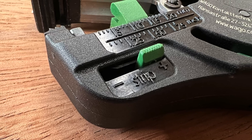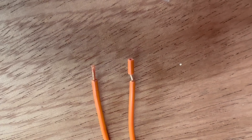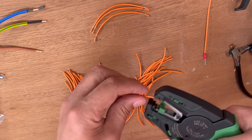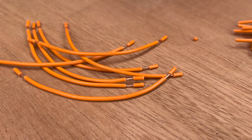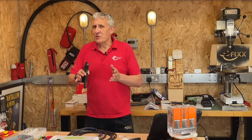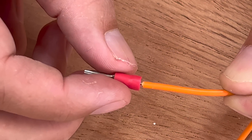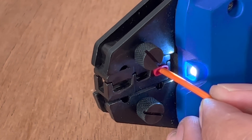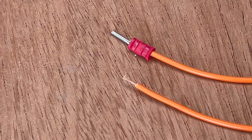Now let's talk about that mystery function. By using this lower slide, you can part-strip a conductor, leaving the insulation slug intact at the end of the conductor. This technique comes in handy when preparing a large number of conductors that need to be terminated or ferruled later, as it prevents the individual conductor strands from fraying, making it more difficult to put the ferrule on. Also, the slug enables you to twist the wire. The topic of twisting a wire before crimping a ferrule generates a lot of comments — some prefer to twist slightly to mimic the original conductor twist, while others don't twist at all. So what's your take? Share your opinion in the comments.